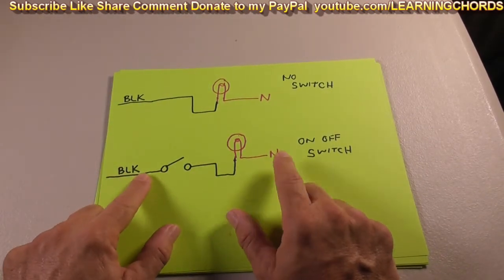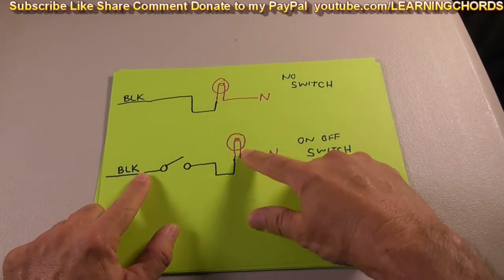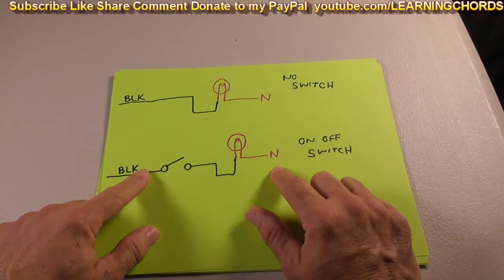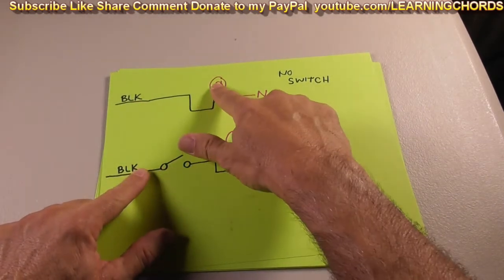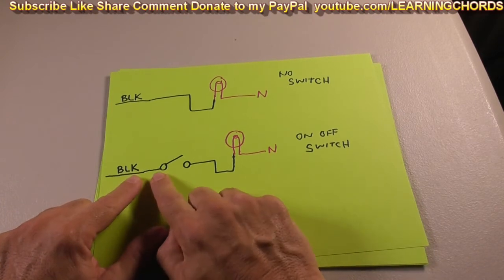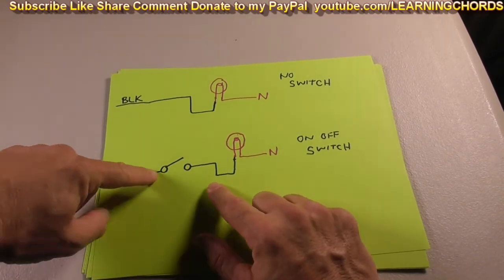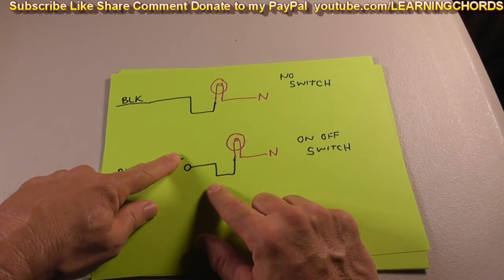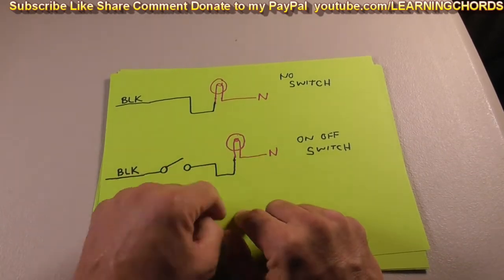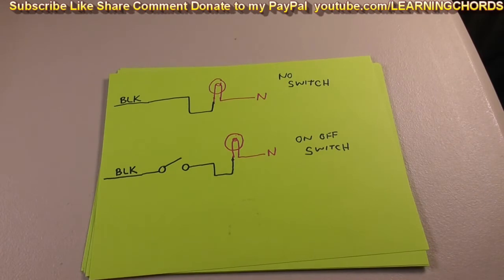Power goes in. We have the neutral, which is connected straight to the light. Power goes in, whereas over here, the power can go to the light and turn it on. With this circuit, with a switch in it, when the switch is open, power goes in, goes to the switch, stops, doesn't complete the circuit. Switch is closed, power goes through the switch, turns on the light, we have power.